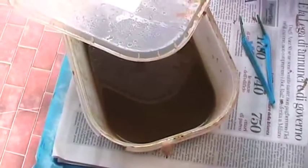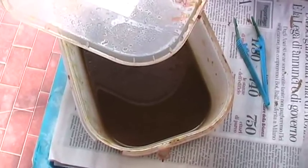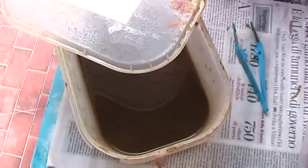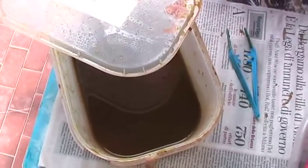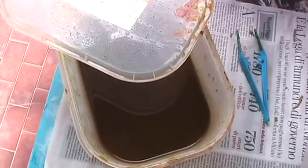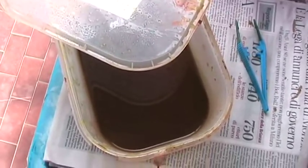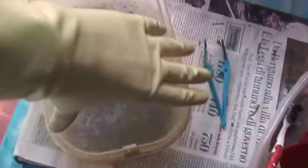Of course, if the etchant is new, it will take less time, but if the etchant is old, it will take more time. Also, temperature eases the etching process. A higher temperature will make the etching faster, and movement will also help the etching process.